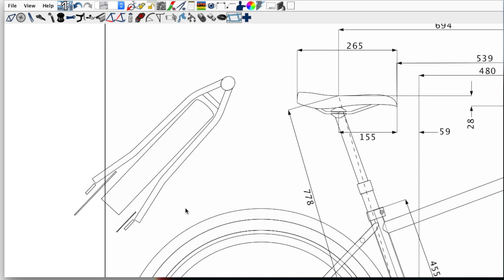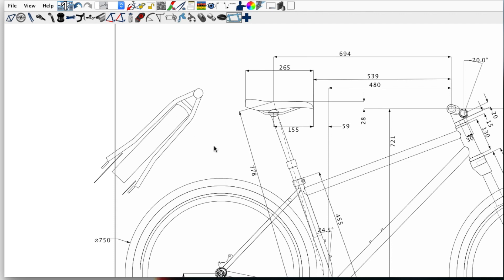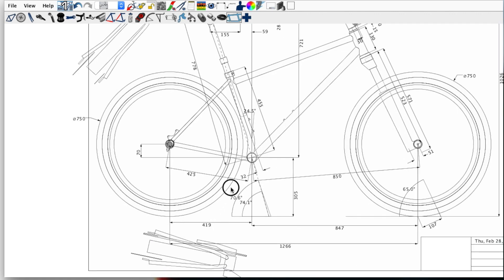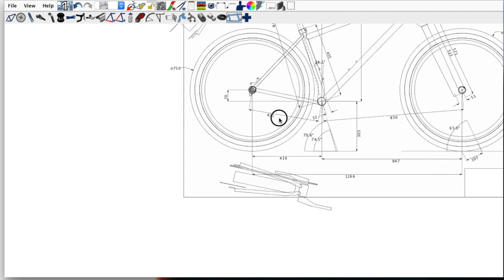If you practice with this method, you could get pretty dang good pretty easily. There might be more features in BikeCAD that help with this sort of thing. If you didn't have a way to model this and measure the angles, it would be really frustrating. BikeCAD is great because it lets you model and see what different things look like — you can say, I want a little more heel clearance, or what would it look like if I changed the radius of the die on this end? You could do a larger radius bend on one end and a tighter radius on the other. It's cool that you can model it and see it quickly. BikeCAD is decent with seat stays; chain stays are tougher because you're often smooshing tubes around the tire or chain ring or using a chain stay yoke.